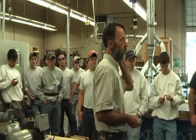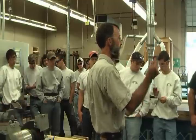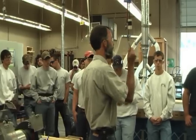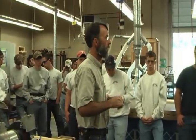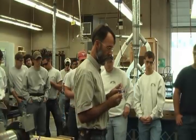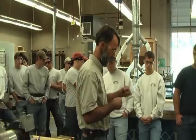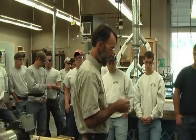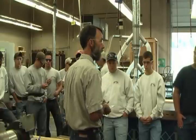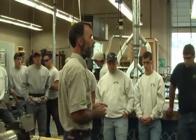You can sand it off, you could probably use a wire wheel and take that off. I've got spare blades. Once I've sharpened the chisel, if I'm going to put it away, I'll wax it and put tape on. But this one should be sharp. But they come in handy, like I said, when you need a short chisel for something. And it's also pure bliss to use a nice sharp blade on a plane.